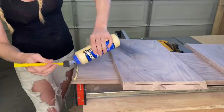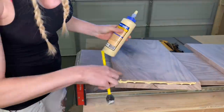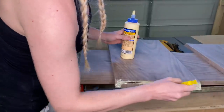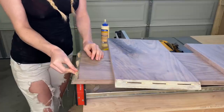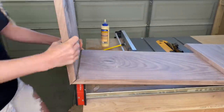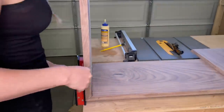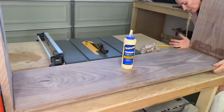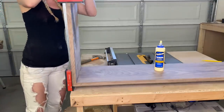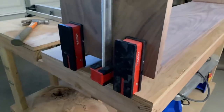I'm using big clamps and type 1-2 glue to glue the pieces together. Apply a thick but even layer of glue to both sides — the easiest way to spread it evenly is to use one of those rubber brushes. Stick the biscuits into the slots, then take the side piece and attach it to the top piece. Wiggle the piece around until it fits perfectly, then place it into the clamp. Follow the same steps for the other side. Once the pieces are perfectly lined up, tighten the clamps. To get even pressure horizontally and vertically, attach multiple clamps. Let the glue dry for about 24 hours.